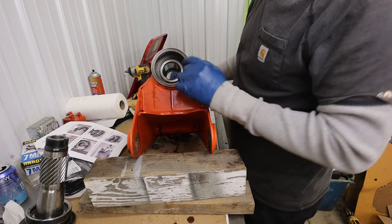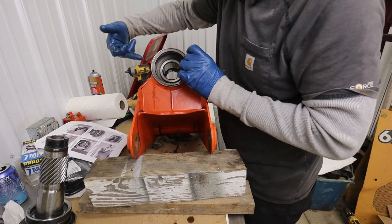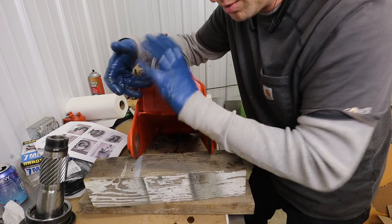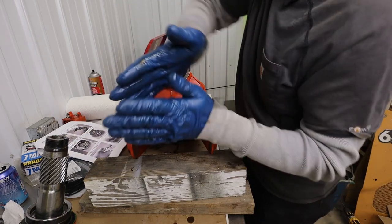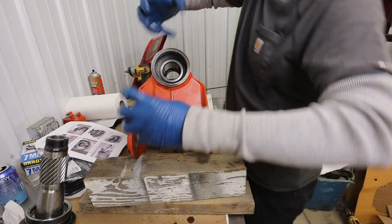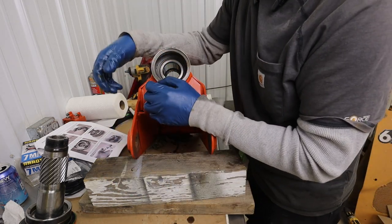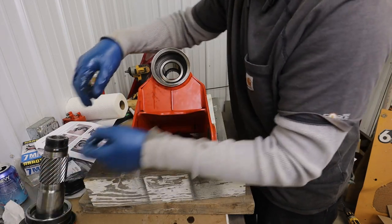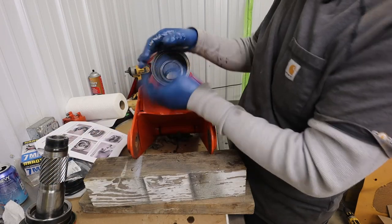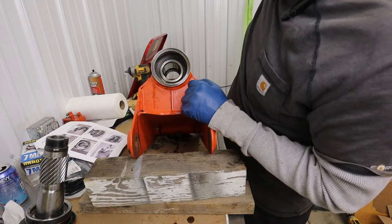So because the piston and the shaft and the outside are all geared together in opposite direction, you almost get a 2-to-1 effort. For every inch of stroke, you get twice the rotational degree as you would with the exact same helical gearing here with a single action. So it's kind of a double action, linear to rotary actuator.